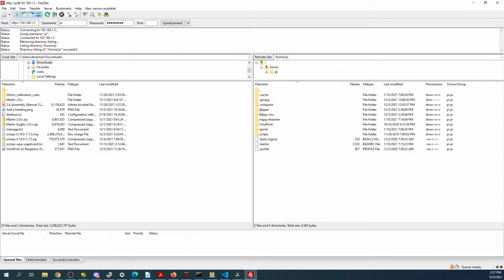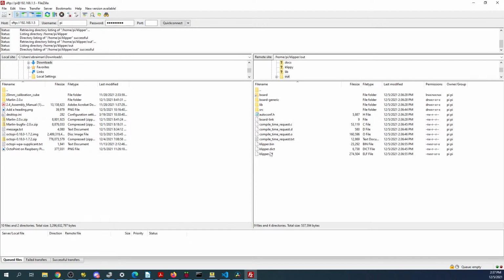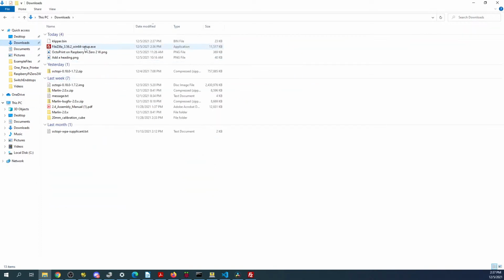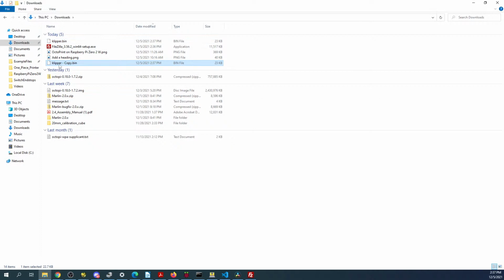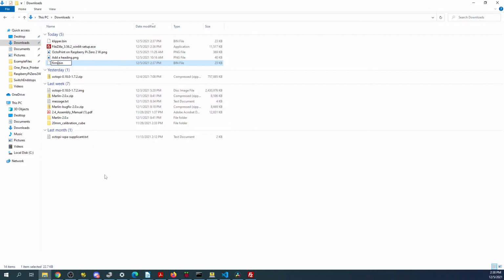So we're going to have to find the Klipper directory. Then it's the out. And inside the out, we have Klipper.bin. So we'll carry that over to our downloads. Then we'll go back over to downloads. And we'll rename this, or copy it first, and then paste. And what we'll do is we'll rename this one firmware.bin. And then we'll see what happens with the file load.